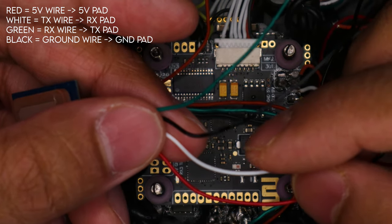Go into the Modes tab, find GPS Rescue, click Add Range. You'll need to set it to Auto so the flight controller detects which switch you're toggling. For mine it was Auxiliary 6 on my Taranis QX7. Toggle your switch on and off to get the precise position range set for the on position. Once your switch is set up for GPS Rescue, click Save and move on to the next step.